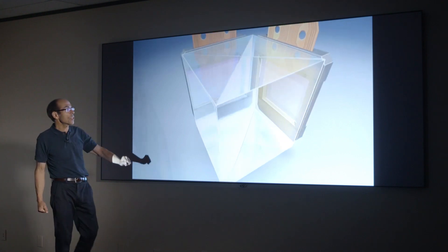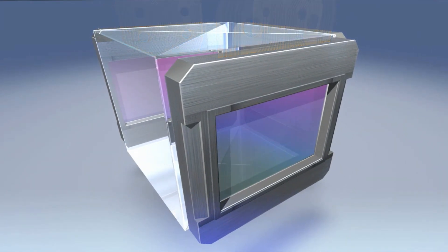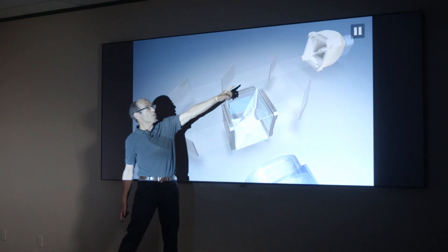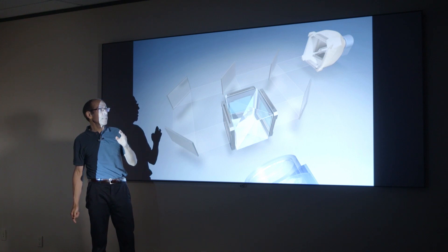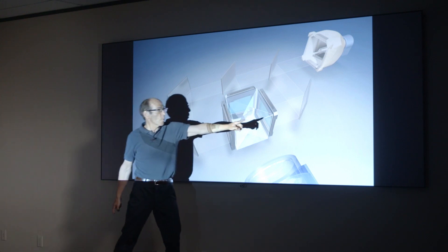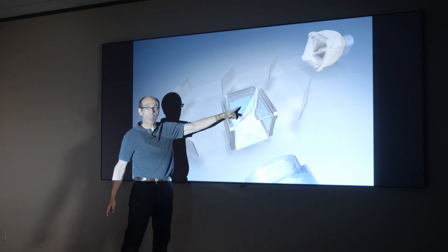Here's the lead crystal prism, and here's gluing the LCD chips to the prism. There's the lamp over on the far right. These two things here are mirror filters that separate the colors. Remember, everything we see in video is composed of certain proportions of red, green, and blue. These are ordinary mirrors — one, two, and three — and here are our three chips around the beautiful lead crystal prism.